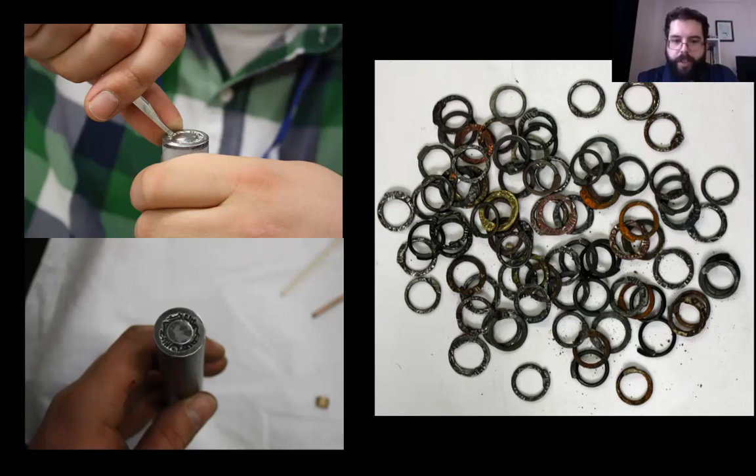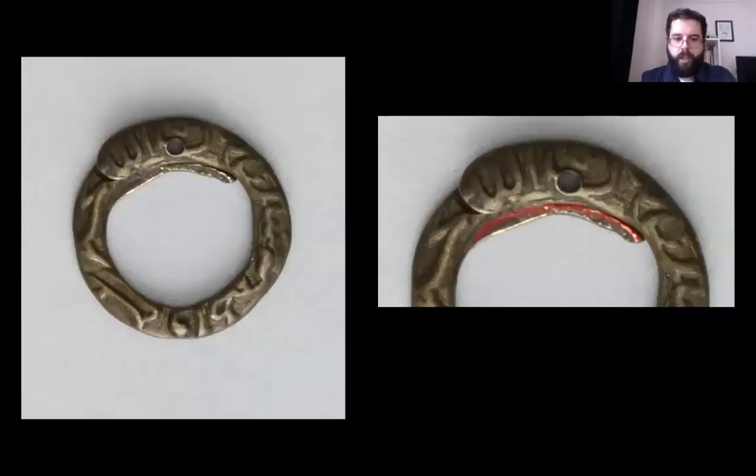On the right, you can see some of the dozens of rings that were made during testing. The tests achieved their best results using the prototype as an anvil die with a matched hammer die, rather than as an anvil die struck directly with a hammer or as a loose hammer die struck over a flat anvil. There are some misstrikes in the rings that give us an indication as to the shape of the die itself. There were several rings with a flattened lip around the inside of the ring, seen here picked out in red. This mistrike tells us that the inscription was sunk into a channel in the die, and the flare is caused by the rear overlap of the wire being misaligned and crushed against the raised center of the die. Having a shallow channel sunk into the die would help hold the ring in place during striking.